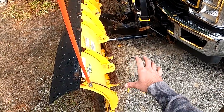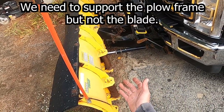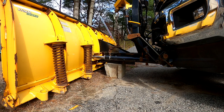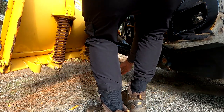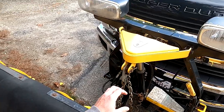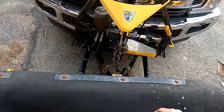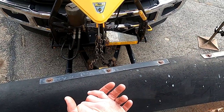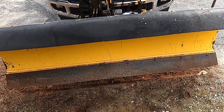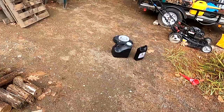For us to be able to freely drain those bottom pistons, we're going to end up having to let the plow down so that the blade is free to spin. I'm going to put a block and a few pieces of wood underneath there just to keep it suspended in the air. Our top piston is pushed down as much as it needs to be, and the blade is hoisted in the air so that when we release the pressure in those bottom pistons, we can manually turn the plow left and right.